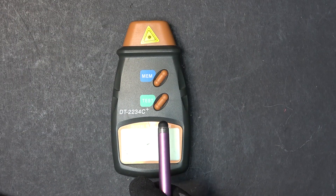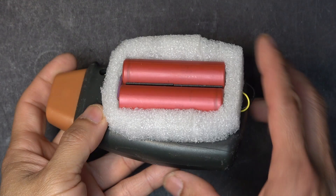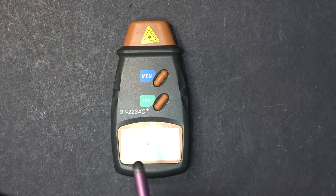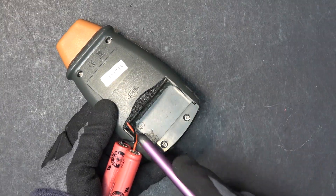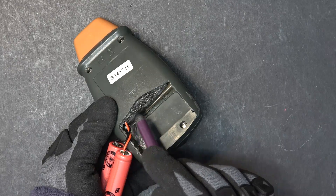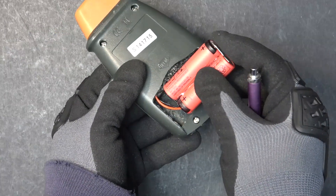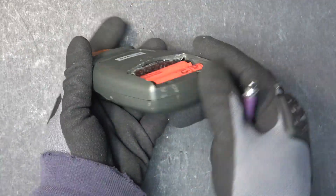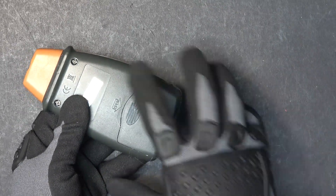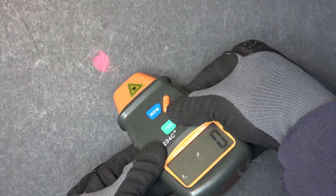The next device I want to modify is my tachometer. I also modified this one with a pair of 18650 cells and a foam case, but it looks extremely hideous. So I remove the 18650 and foam case. The battery housing is a little too tight and small for the 14500 cells, so I cut out a piece of plastic to make enough room for the 14500 pack. Now it fits in perfectly, I can close the cover easily, and it's working perfectly.